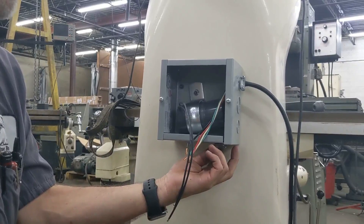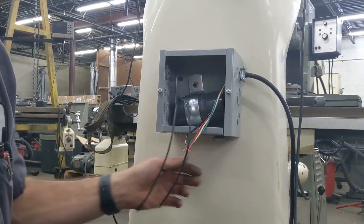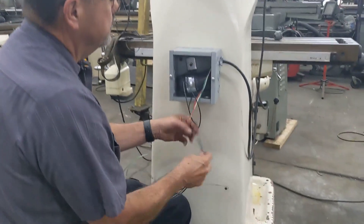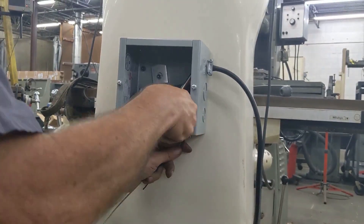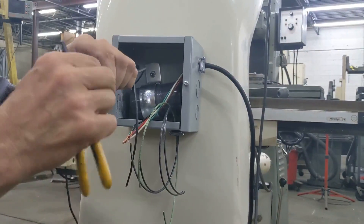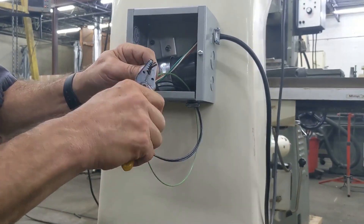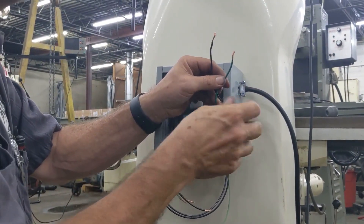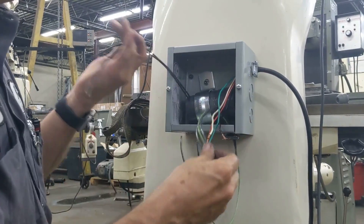What I'm going to do here is put three wires in as a stub until the customer gets it home and hooks it up directly. So basically this is simulating your 220 single-phase wiring coming through — I'm going to run it on up and in. Let's strip our wires a little more; personally I like a bit more room on that. So now here we go: we have four wires — three hots and a ground coming from your motor. Here are your three wires that would be going from your power source, and then here are your phase converter wires.